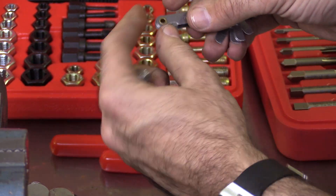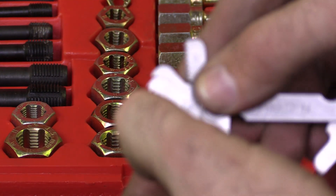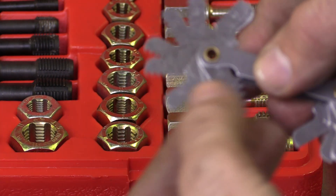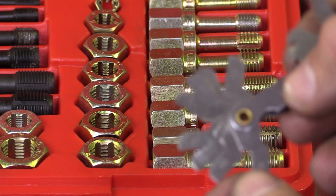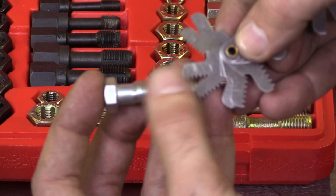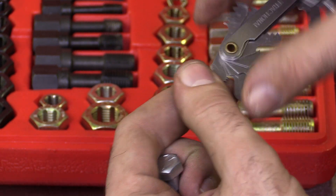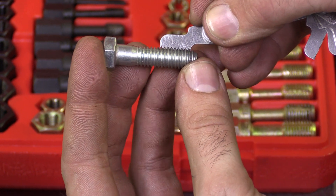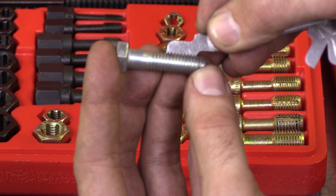I'm going to fan this out so we can hopefully see the numbers on these blades. You can see that these teeth are different distances apart on these different blades. I'm just going to use this as a comparator to figure out which one of these fits the best — and of course we know that it's going to be the 16. I'm going to fit that down in there, and you can see that fits really nicely. So now we've determined, yes, for sure, this really does have 16 threads per inch.